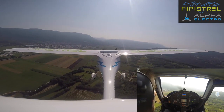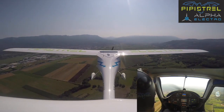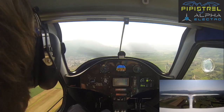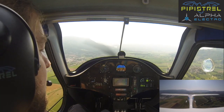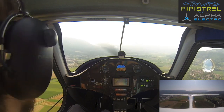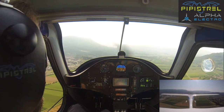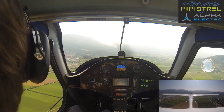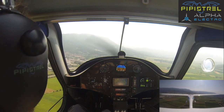Now this is a good time to check the temperatures. Our state of charge is 74 percent. Our motor temperature is 64, so that's below the limit. Our inverter temperature is 52, and these two will drop. We also have 34 degrees centigrade of battery temperature. Remember, battery temperature during one course of the flight — we cannot expect that it drops.